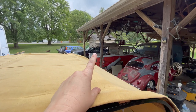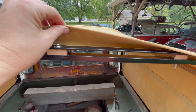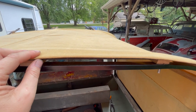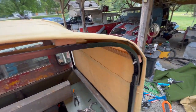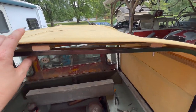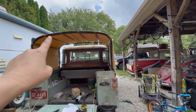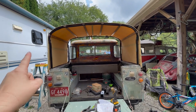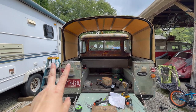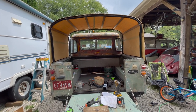When I'm doing these, I roll in the extra so that you have kind of a finished seam. I'll sew my other piece in under here, and when I stitch on top you won't see that. I think that will work. We basically just need to get a corner measurement, an up-there measurement. And lucky for us we have this arch because I made a buck, and the fabric fits the buck, so we know we can cut our fabric using that. I'll take our buck and draw that on top of the fabric, then work it in and pin it, then work in our webbing.